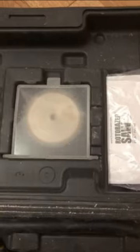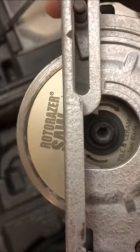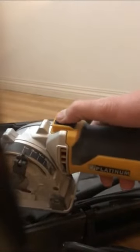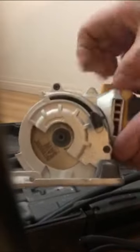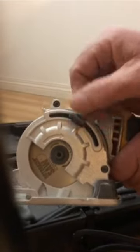This is a great plunge saw and it comes with three blades: an all-purpose blade, a carbide tooth finishing blade, and believe it or not, a tile blade, which I already have installed in the saw for this job. I'm only cutting through the grout lines to separate the good tile from the bad ones, and the great thing about this saw is it allows me to set the depth to the thickness of the grout, which is only three-eighths of an inch.